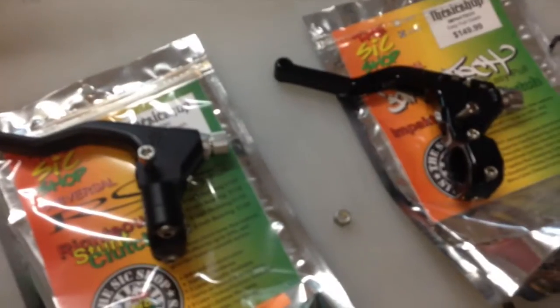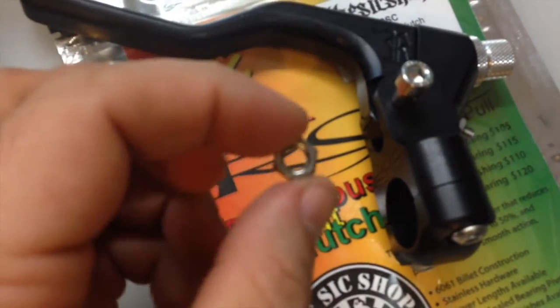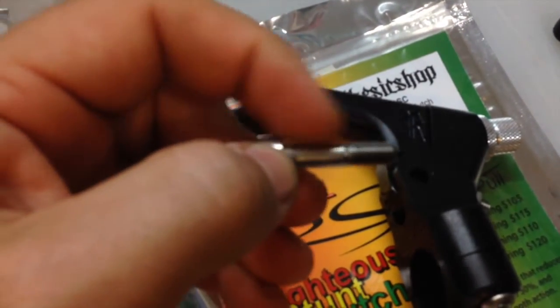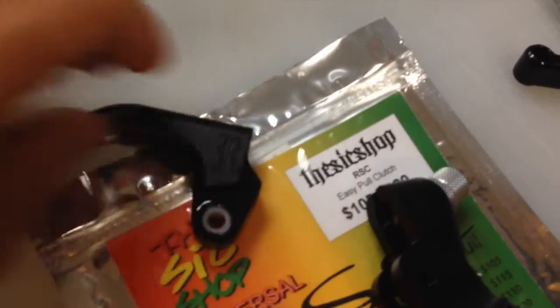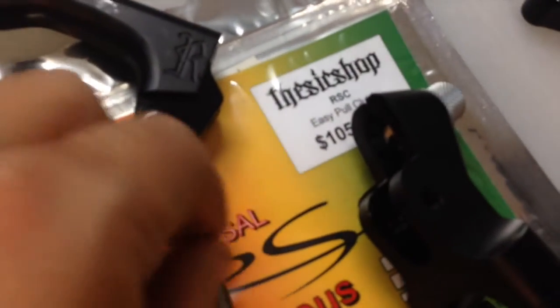If you're interested in the inner workings, here is the RSC. There's a nylock lock nut that goes on the back side, and this is a shoulder bolt — it has a smooth section that the bearing pivots on with no threads there. This is the bushing style with a plastic bushing, and this is the bearing style — it just sits in there and pivots on the bolt. This is all stainless steel hardware.